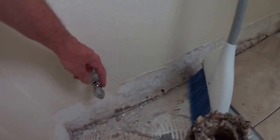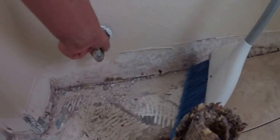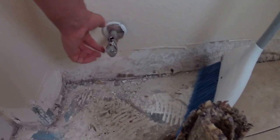This is a common issue here — these little angle stops or valves like this. Frequently what happens is that these things have been in one position for a long time until the rubber hardens and then they won't go off all the way. These are about $20 by the time the labor and everything is involved. We end up having to replace these fairly often. This is Barry — he's riding along today.